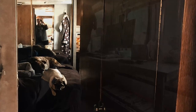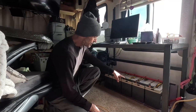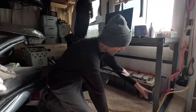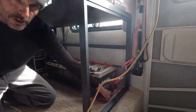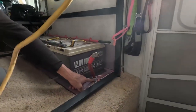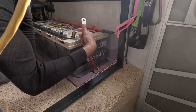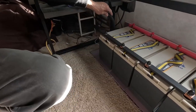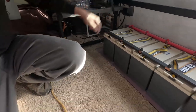I've got the battery down here mounted now. With all five batteries put together, this is one giant battery. I've run my lines in through three-quarter inch PVC so there's no chance the wiring can ever get marred or anything get into the coating. It's not hooked up right now, but the positive will come over like this and the same thing on the negative — they come through almost airtight, and I've already got the other ends on as well.